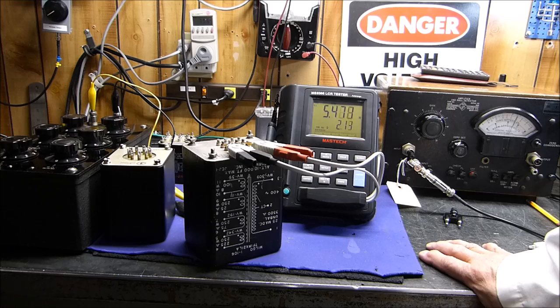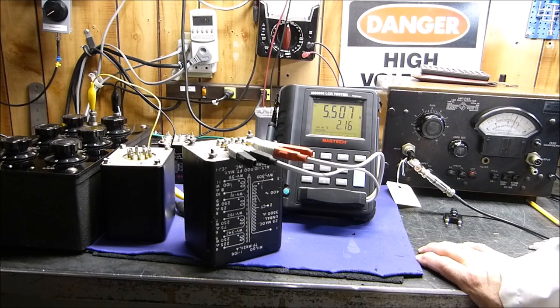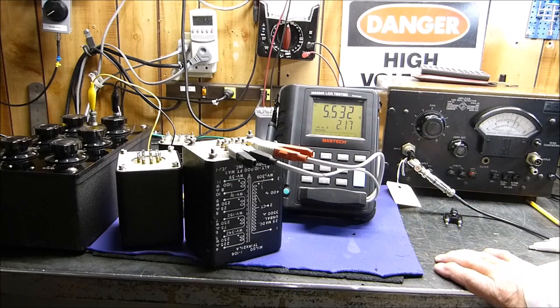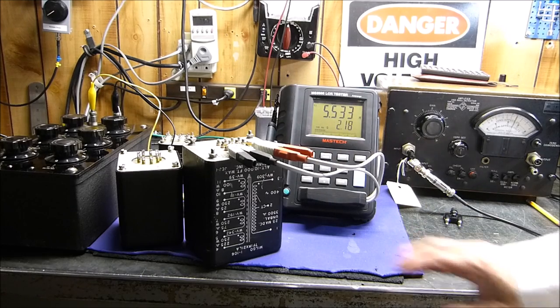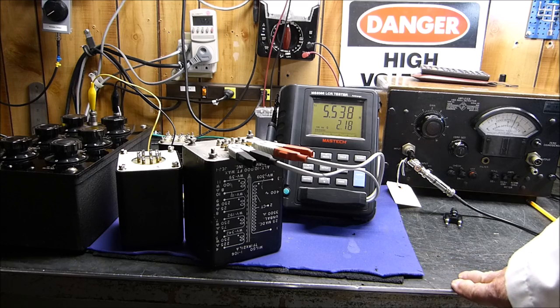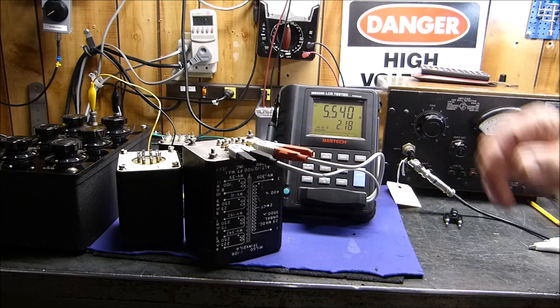5 henries. This one is like 70 henries. This one's 5 henries. I think that's where our low frequency response is so much improved in the little amplifier. I mean, the little transformer here, a high quality one, probably from a soft core. Yeah, I have spent untold hours out here fighting these things. Okay?